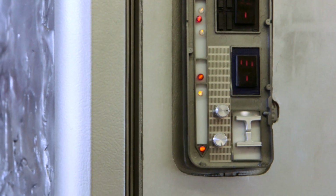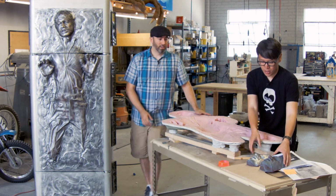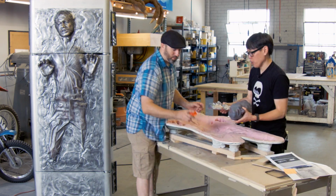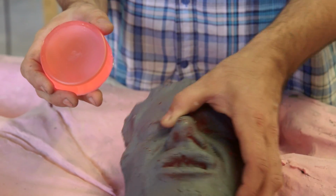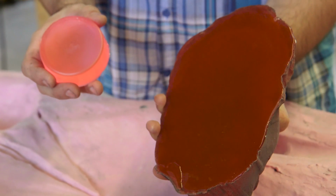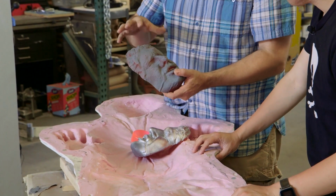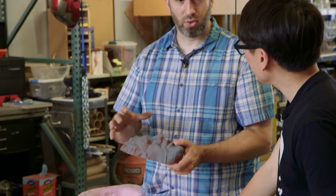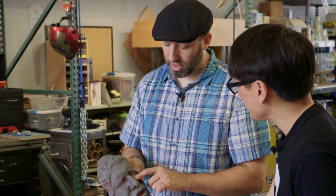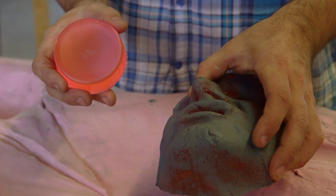And then the material you cast in itself. So your mold is silicone. Silicone mold. Yeah. And then you did some test castings of different materials. Yeah. Just for the translucency, right? Well, the translucency is this kind of light pinkish color. Right. And the first casting I did, I just dumped the resin in, and with most of these clear epoxy resins or even polyesters, they don't like to be cast in thick sections. And I learned that when I did this first one. It's got all these little lines on it. Looks like it's made out of lava or something. So I had to fill it in increments.